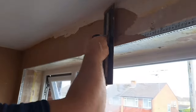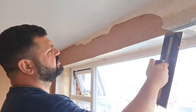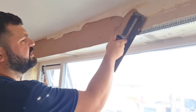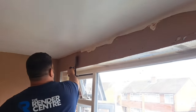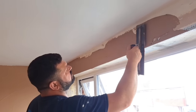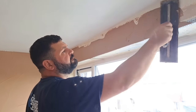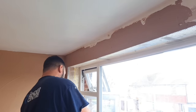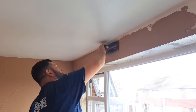So you always want to fill out your beads across them like this, because they're quite thick, especially these hook-on beads. These are extra thick compared to normal beads. So you always want to go across first, so that the thing is completely filled out. Like so. And then you can start closing the edges in.